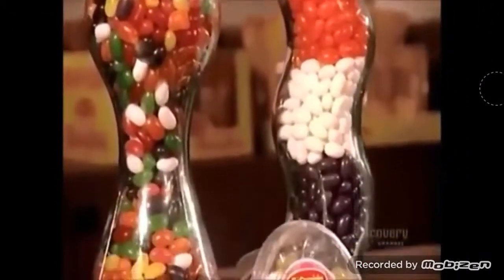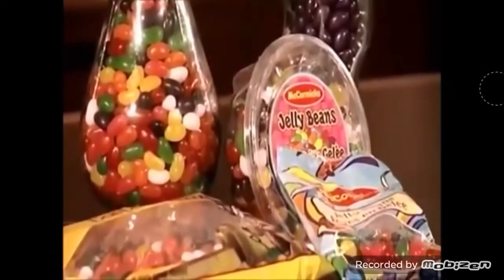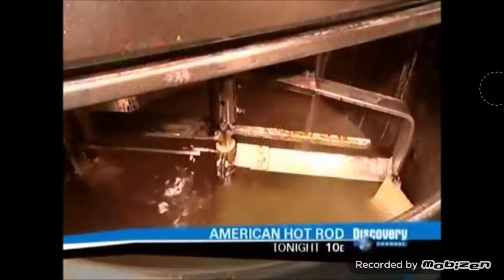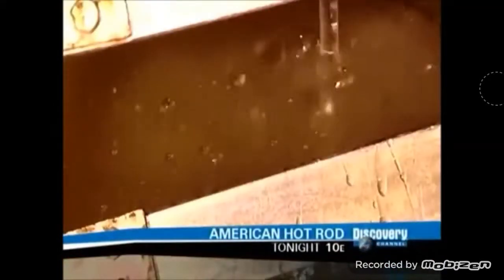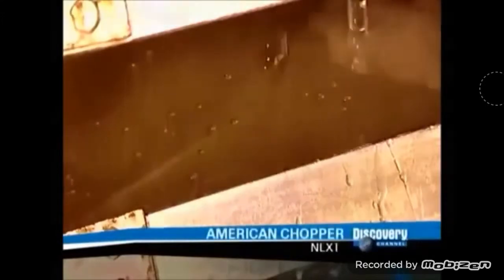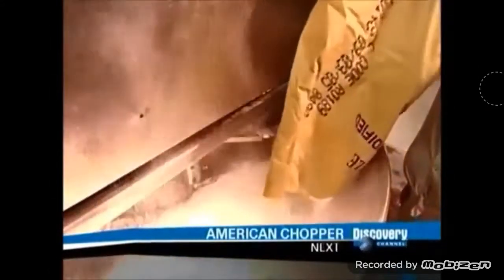The jelly bean is a sugary sensation. Billions are sold at Easter alone. To make jelly beans, they heat liquid sugar in a big kettle to about 175 degrees Celsius. They add glucose, which is a more concentrated sugar, and then starch. An agitating device mixes it all together.